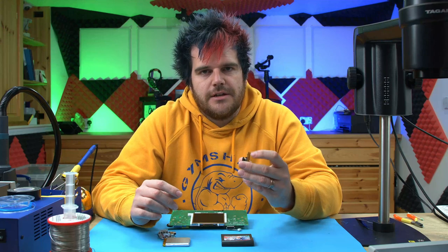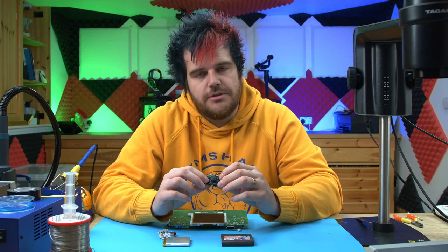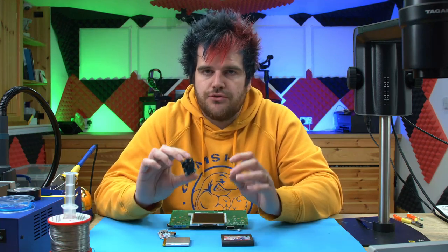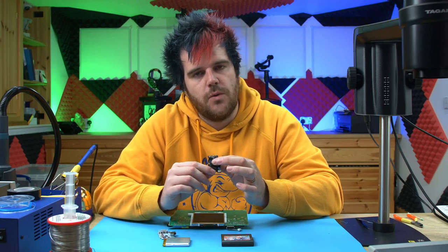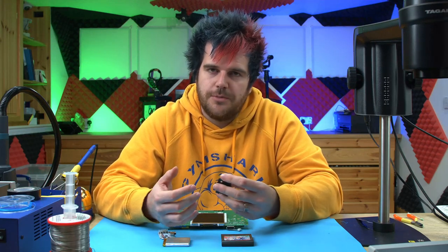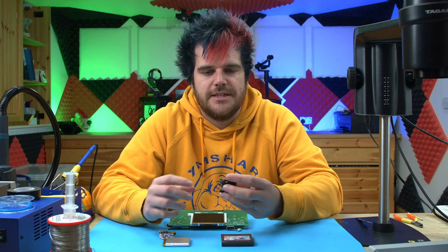What this does is convert a true analog stick, an actual analog stick with infinite readings of resistance, and using some hardware, convert it to pure digital instantaneously, thereby converting an analog stick to a true digital stick, where you can calibrate the position at which you move this as to when you want it to trigger. So you effectively have sensitivity control, as well as adjusting to your personal feel to make sure you're happy with how the thumbstick responds, whether you want it to move less or more, the sensitivity level.